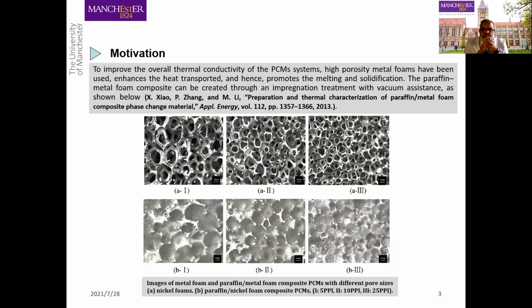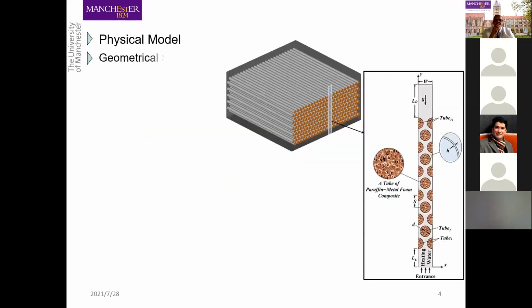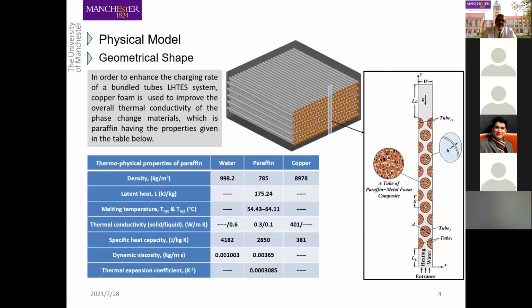Anyway, our focus in this project is on using the metal foam. The metal foam, as you see, is a matrix of interconnected pores that allow the fluid to flow inside. They are made of metal, so they already have the feature of high thermal conductance. So this allows us to transport heat efficiently and, in the meantime, reduce the pressure drop penalty. Those aspects have already been covered by Dr. Adesoni. No need to waste time on them.